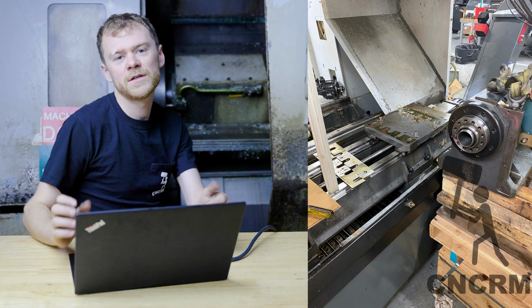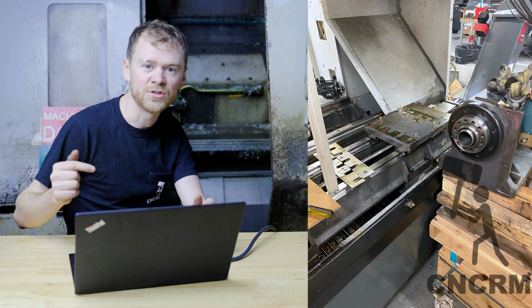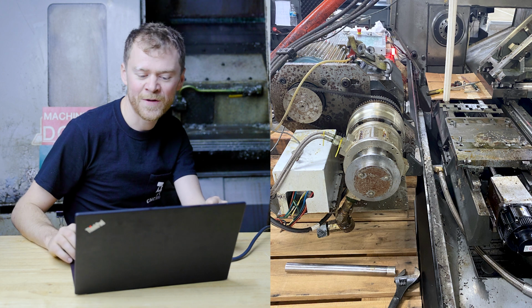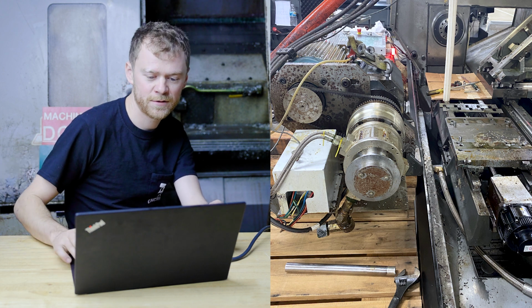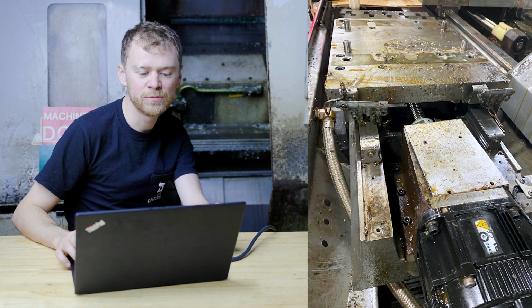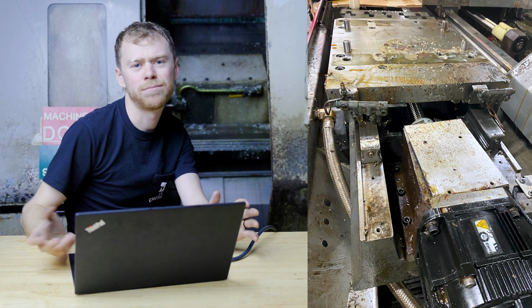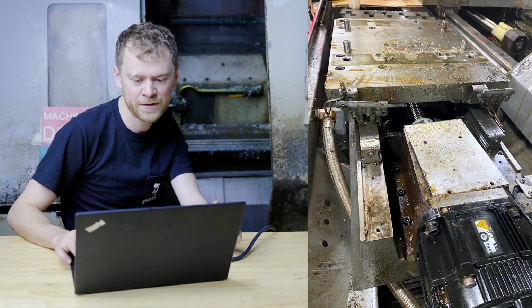Pulled it out. It sits on a sub plate just like the tailstock does, and it's pinned and shimmed. So you can see here from the back, now it's out, also where the shims would sit. Those are ground shims for getting the height correct. And now I'm gonna pull the motor, gonna pull the rest of the lube lines. I did roughly indicate it in just to see where that plate was, and the plate was within a few thousandths, so I know it's not crazy.